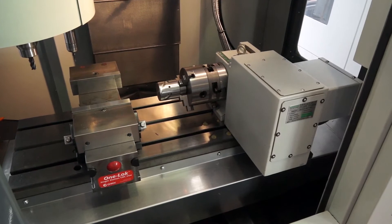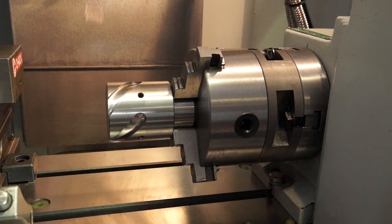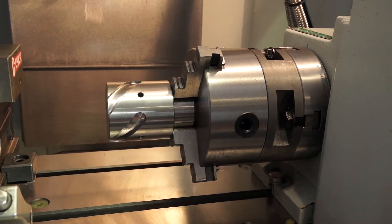Let's look at a couple of other details. The max tool weight on this machine is 5 kilograms. We've got a tool change time of 6 seconds, so it's pretty quick for a small machining centre. The actual weight of the machine is 2500 kilograms — it's not a small machine, and if it weighs a lot it's obviously going to help and assist when you're removing metal.